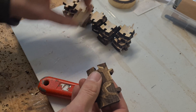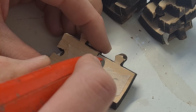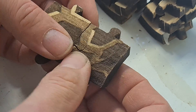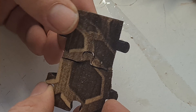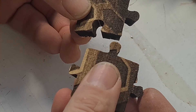There is an issue with rotary cutting a jigsaw puzzle, and that is that the tabs and holes are aligned to the central axis of the cylinder. Naturally, of course. So that means that the tabs and holes are wider at the top than the bottom — they're in a conical shape. So the tab has to be inserted into the hole from on top, and this can cause some major headaches when assembling the jigsaw puzzle in 3D.